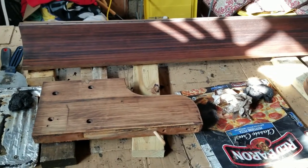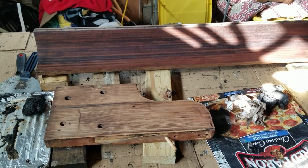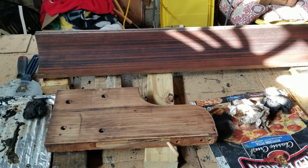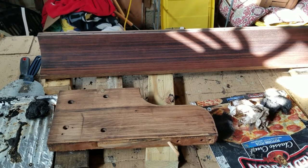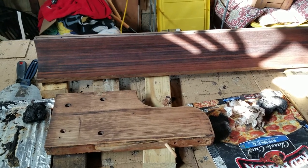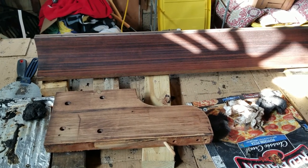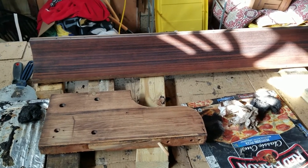In general, that process is just going to get repeated for every piece on the piano. The previous owner attempted stripping and did a lot of the work — I'd say it's probably 95% or higher stripped already. But there are areas where there's still a little bit of old paint remnants or old finish left behind, so I'm going through piece by piece making sure it's really back down to the wood before I start sanding, staining, and refinishing.